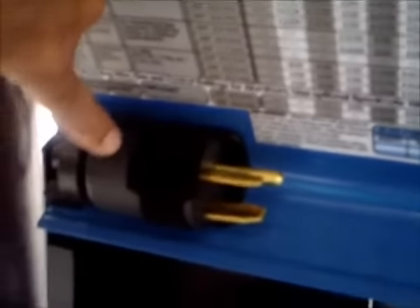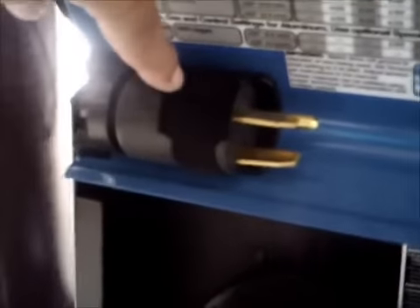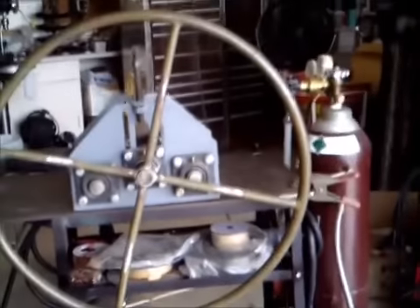Up here we have the multi-voltage plug. This is a 230-volt plug — you take the 110 plug off and screw the 230-volt in, and you can plug it into 230 volts. This is the cart that I made — one of my projects. It's got the torch holder on one side and a ground clamp on the bottom. The ground clamp is on bare metal; the entire cart provides the ground for my work. I've got my tank strapped here for safety — this is the shielding gas, the 75-25 argon CO2 mix.